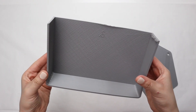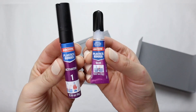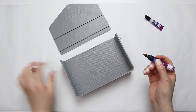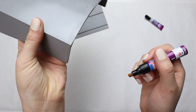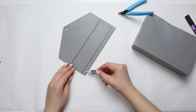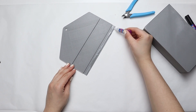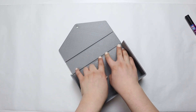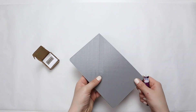The first two pieces I assembled were the lid and the back sides. I cleaned up the seams on the back piece as well as the overall print. To adhere the pieces I used Loctite glue for hard-to-bond plastics — the glue comes with an activator which is essentially an invisible ink marker. I applied the activator, then started to apply the glue — it was pretty runny, very low viscosity, so I would recommend not pressing too hard on the tube. I placed the back side on the lid's edge using the recessed line as a guide, then wiped off the excess glue.